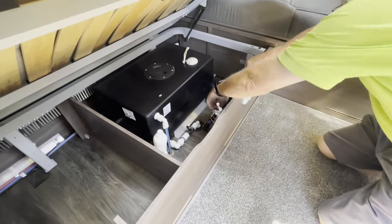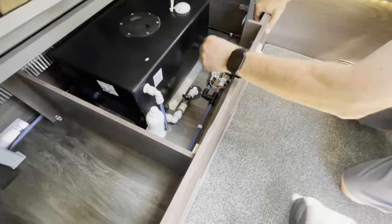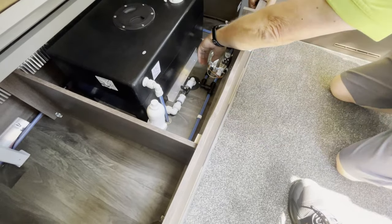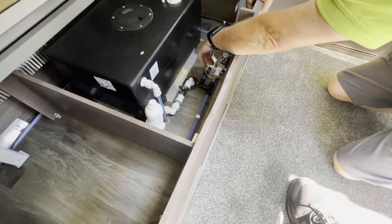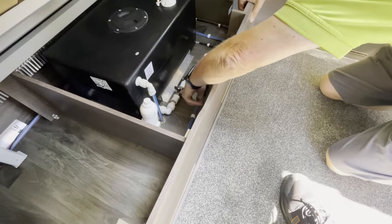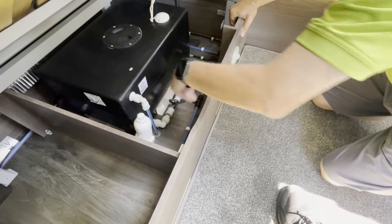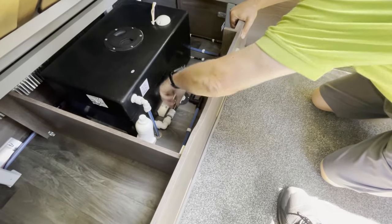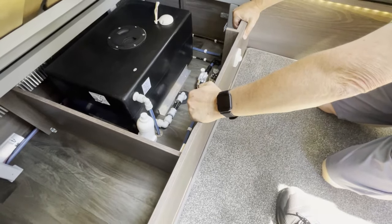With this, there's a pressure switch as well, so if your water's pulsing using the internal tank, just turn this a quarter turn at a time to sort that out. But when you want to drain this out, currently this tap is closed. To empty that tank, gravity will just empty all that water out.